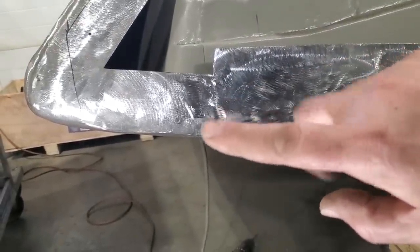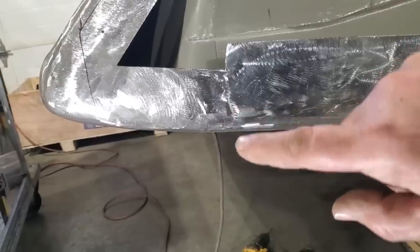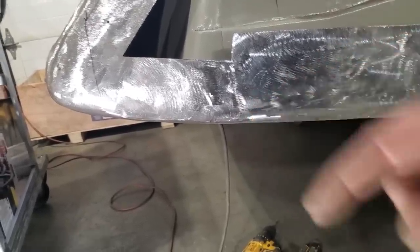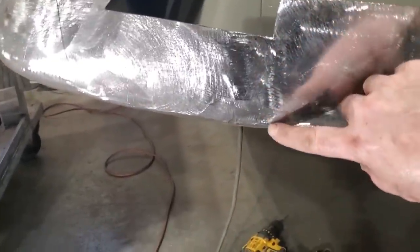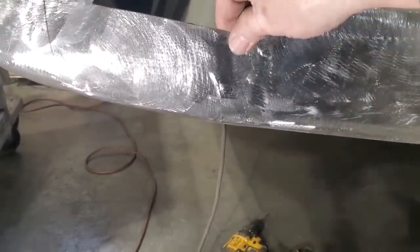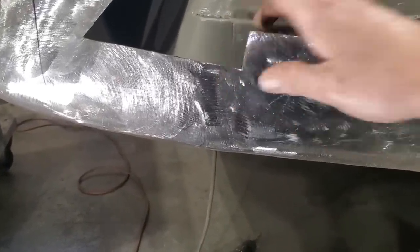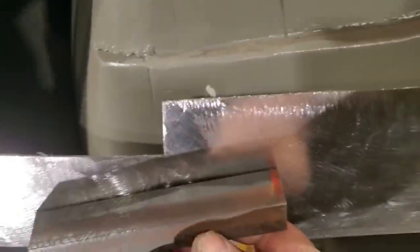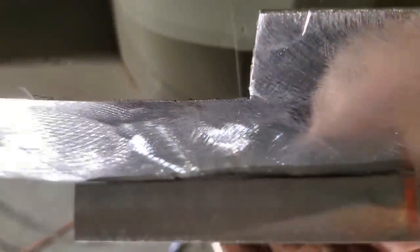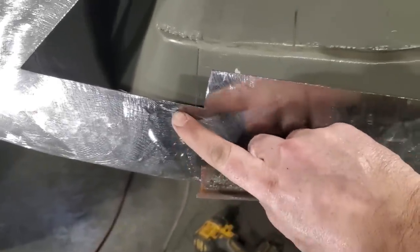And I want to show you something. I just got ahead of myself, and now I'm going to show you something. That's the way I should word this. I hear a lot of guys talking about the metal tucking in and stuff like that. This is what happened here. I blew a bunch of heat into this that time, and then I turned around and tried cooling it really fast. There was way too much heat in there, and this is what happens. That tuck effect goes on there, going down through there. All this here drew in on me because that whole section was heated up suddenly.